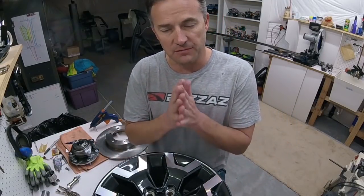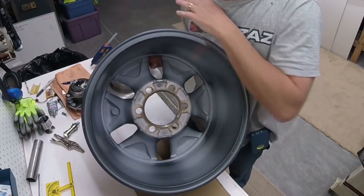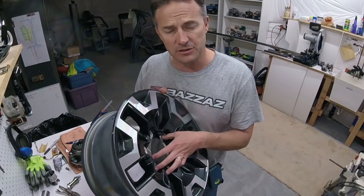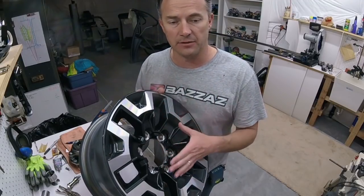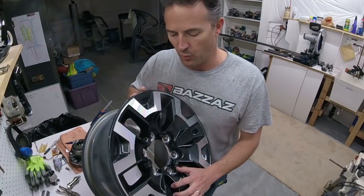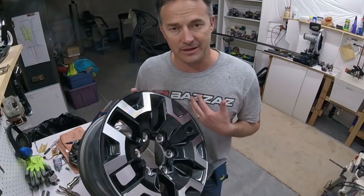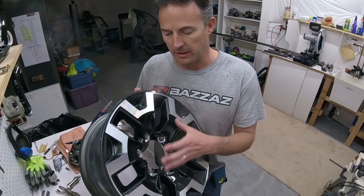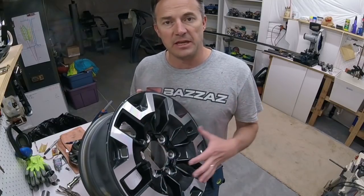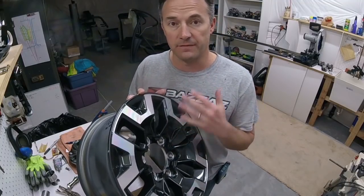What I was specifically looking at was a 16-inch diameter wheel so that I could fit in that 12.5 inch diameter rotor — I couldn't do that with a 15-inch wheel. I bought these off of Craigslist and paid $450 for all four. From everything I saw around here, they seem to go from $400 to $600. These are practically brand new with barely any brake dust on them. Some people are going to notice they're off of a Toyota Tacoma — that doesn't bother me. If that did bother you, you could buy aftermarket wheels, but those would be significantly more money. If you're really trying to do this on a budget, there's also steel wheels people are taking off Tacomas, sold on Craigslist for basically $50 to $75 for all four.